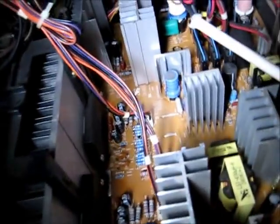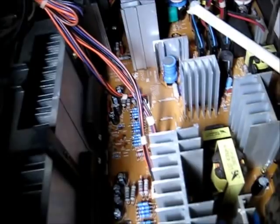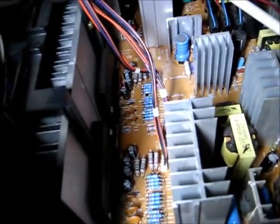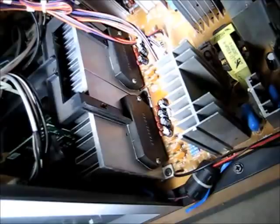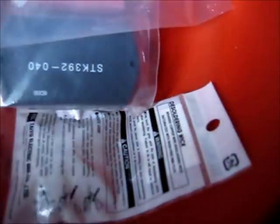I've already been through and checked all those resistors, and they all seem pretty well within tolerance. They're all still good. The capacitors were changed in a previous video, and I've already checked all those resistors — they're all fine. And there are our replacements. You need some heat sink compound and some desoldering ingredients.